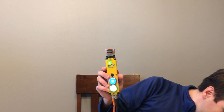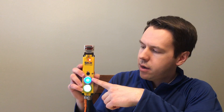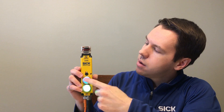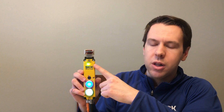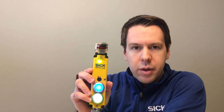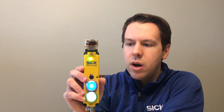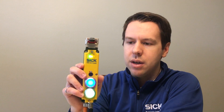What's unique to this device is we don't have to cycle power at all when we fix our wiring error. I have configured fault-present reset on the top push button, holding that down for three seconds. I'm back to normal operation and up and running. Increased machine availability, easy troubleshooting, high robustness with RFID technology. Thanks for watching the latest innovation from SICK.